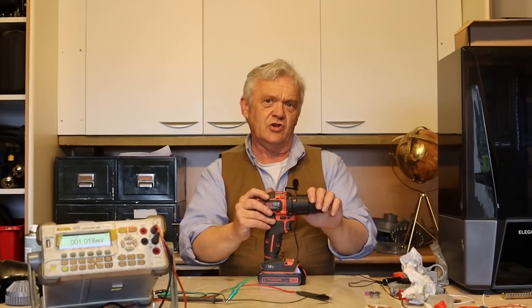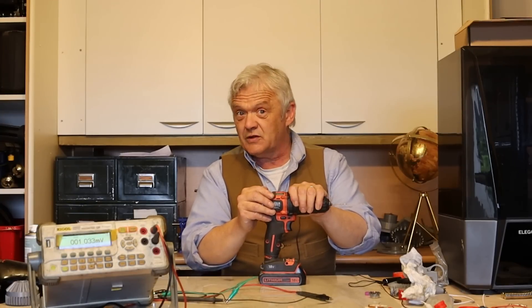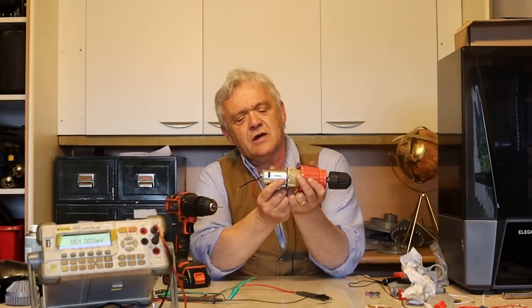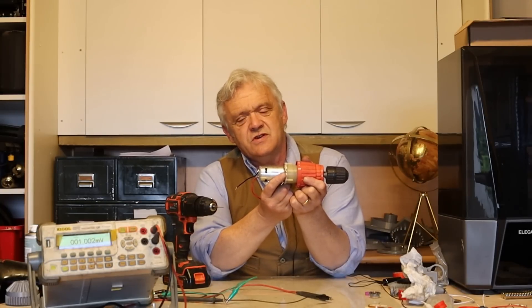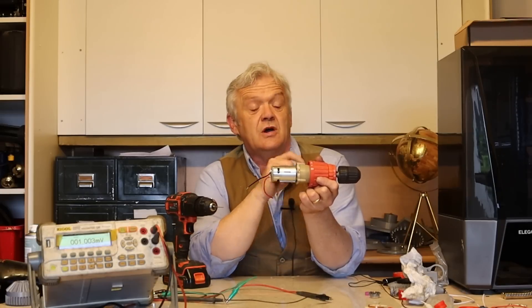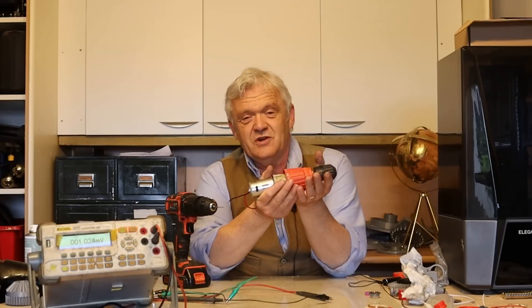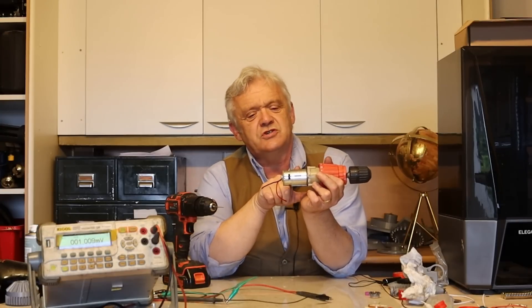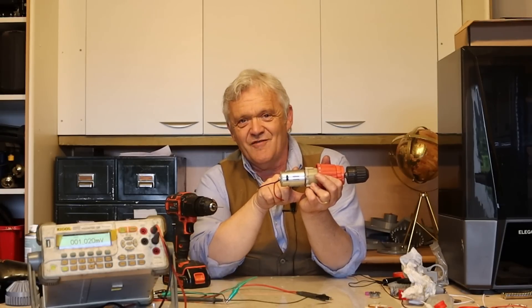I'm going to demonstrate on this motor because it's absolutely everywhere. If we take it apart we get the rotor — this is a really popular motor. If we take it out of the gearbox and spin it by hand we'd probably get about 0.2 or 0.3 of a volt, because we need to gear it to get speed before we start getting voltage. Once you gear it you get speed but you need much more torque to turn it. We don't have a lot of available torque, so it would be really cool if we could change this brushed DC motor into a brushless motor with low RPM, low torque, but high voltage output.